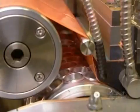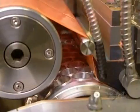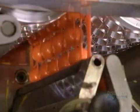The machine presses the gel ribbon into a die with half-circle pockets, each forming one half of a ball shell. The machine does the next 3 steps in one shot. It aligns the 2 half shells together to form a hollow ball, injects the fill, then seals the 2 half shells together.